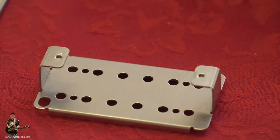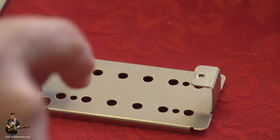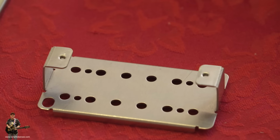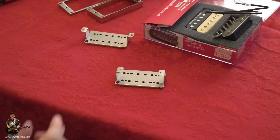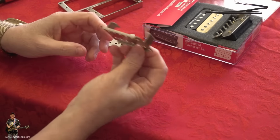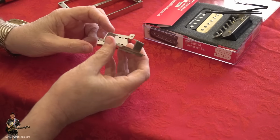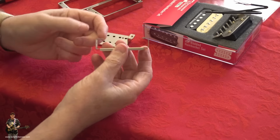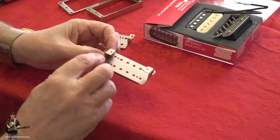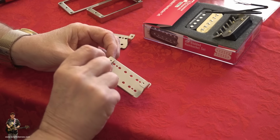How bad's that? And by the way, this pickup is actually pressed from underneath on this plate with springs, so these need to be reasonably strong. So hey, Tony, what's the answer? Well, you couldn't use them like this. Now, I mean, they look great, but trust me, if I just bend them, they'll snap off. They are that loose. So in fact, the last part of bending these, I actually just did in my hand.